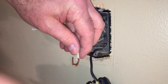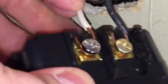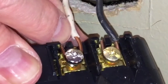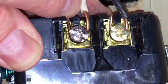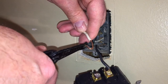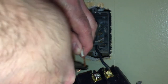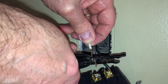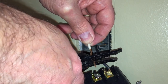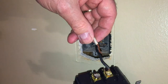Attaching the wires is a pretty simple process, but you'll notice here that I've got too much bare wire on my neutral line sticking out beyond the back of the outlet. That to me is just not safe and we can do a better job than that. So just disconnect it, straighten out your wire, measure out about three quarters of an inch of bare wire, and then go ahead and reconnect it. It'll be much safer that way.